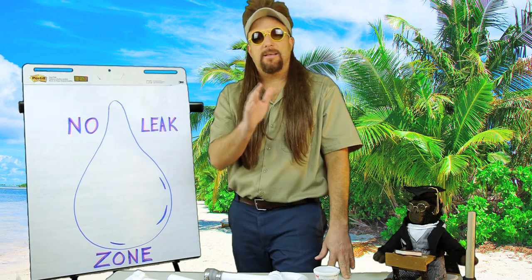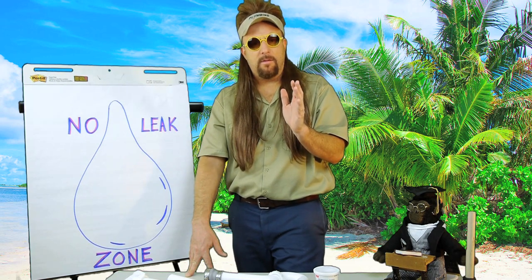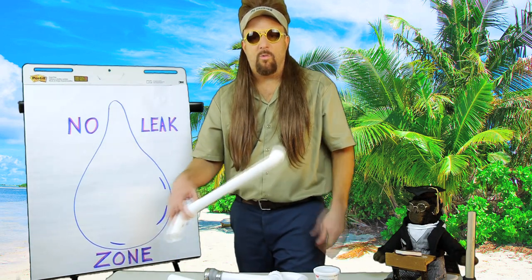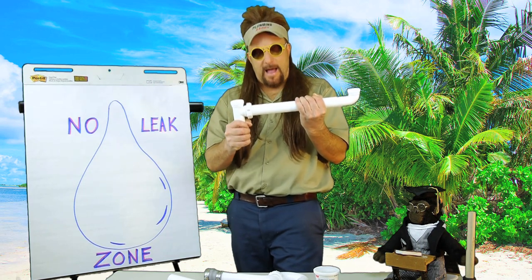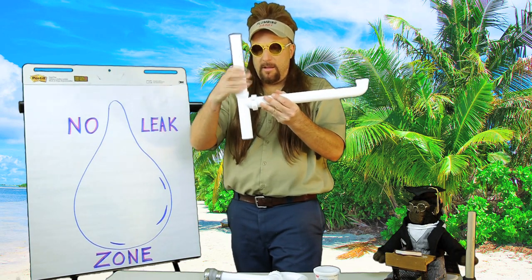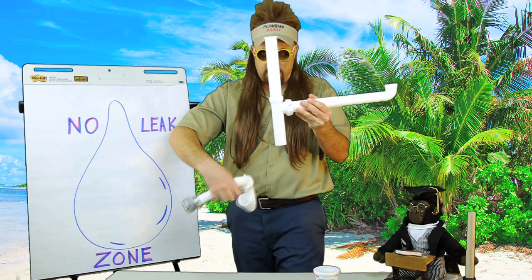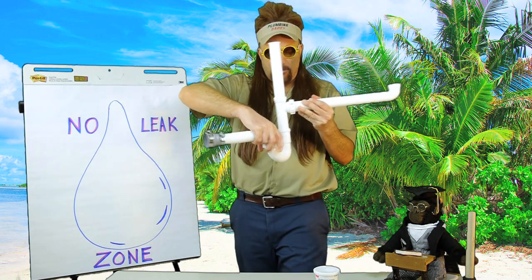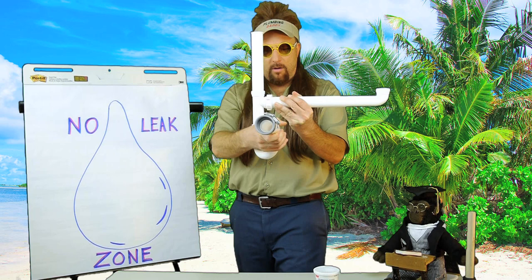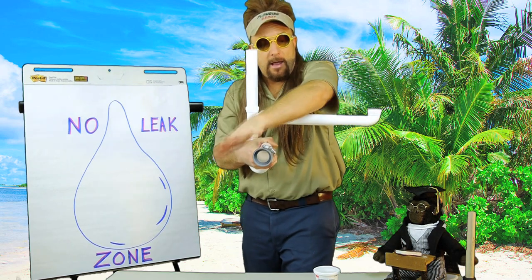The two possible connection contraptions that tie into both sides of the sink are called either an end waste outlet or a center waste outlet, depending on whether the P-trap has to be located in order to connect the pipe going into the wall. This is an end waste outlet right here. We've got two sinks and this is the tailpiece that comes down in here. The reason why we would have an end waste outlet is because after the P-trap, wherever the P-trap goes into right there, it goes back into the wall. Depending on what you use up here is going to depend on where the outlet pipe is.